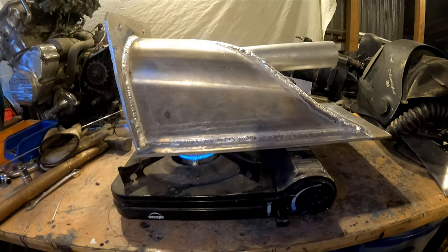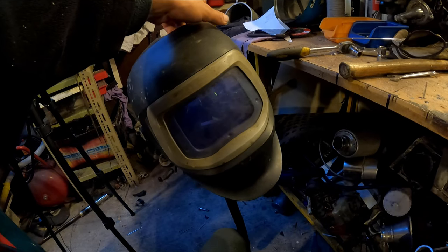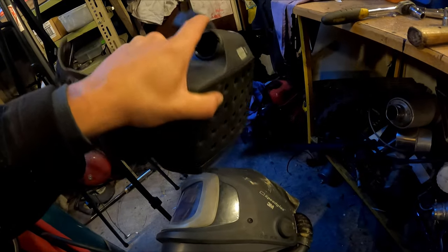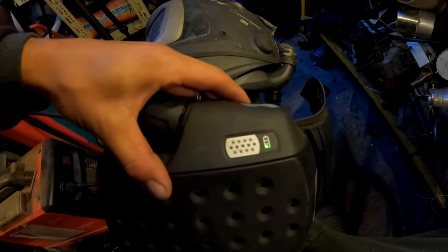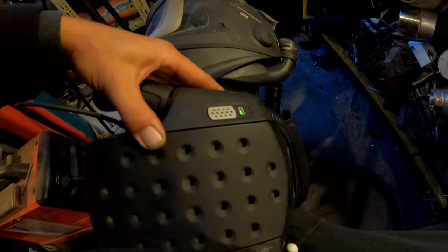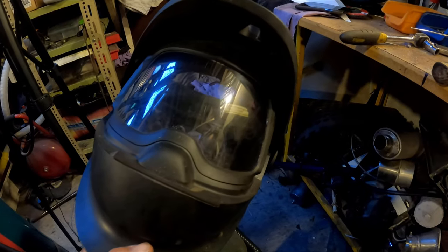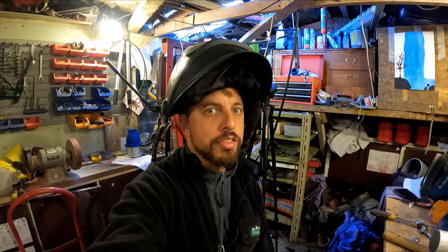While that's heating up, let me talk about this helmet quickly. I've got this 3M Speedglass helmet — I've had it for about six months and use it mostly at work when doing heavy fabrication. It has a little backpack with a battery on the bottom, and I've got two batteries for it. It sucks air through a filter and blows it in where your mouth and face are, which are kind of sealed off. The front flips up so you can grind, and it has an auto-darkening lens you can adjust. It's honestly so comfortable — I even wear it when TIG welding. It's really expensive, and I'm not sponsored by them, I'm just saying it's great.